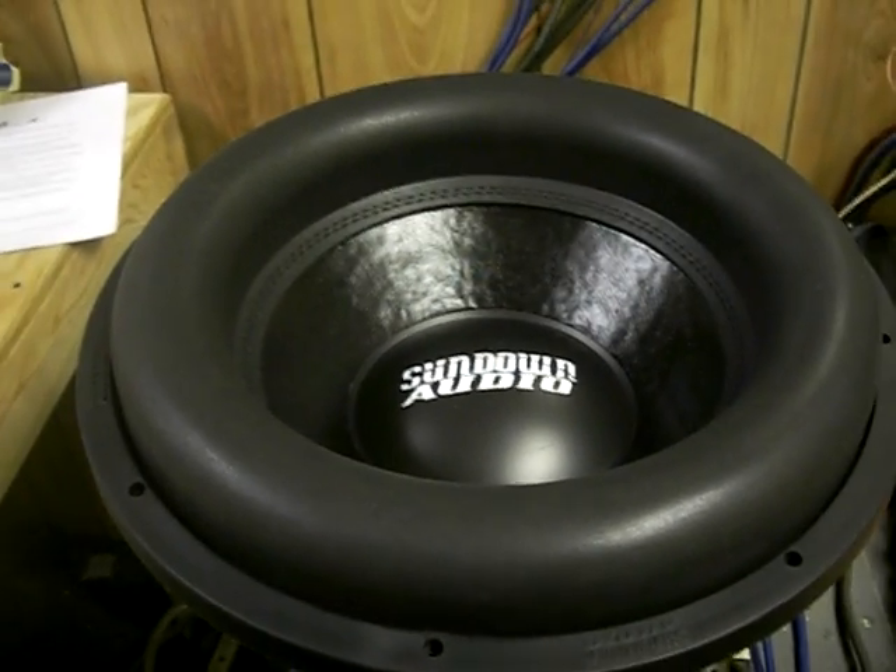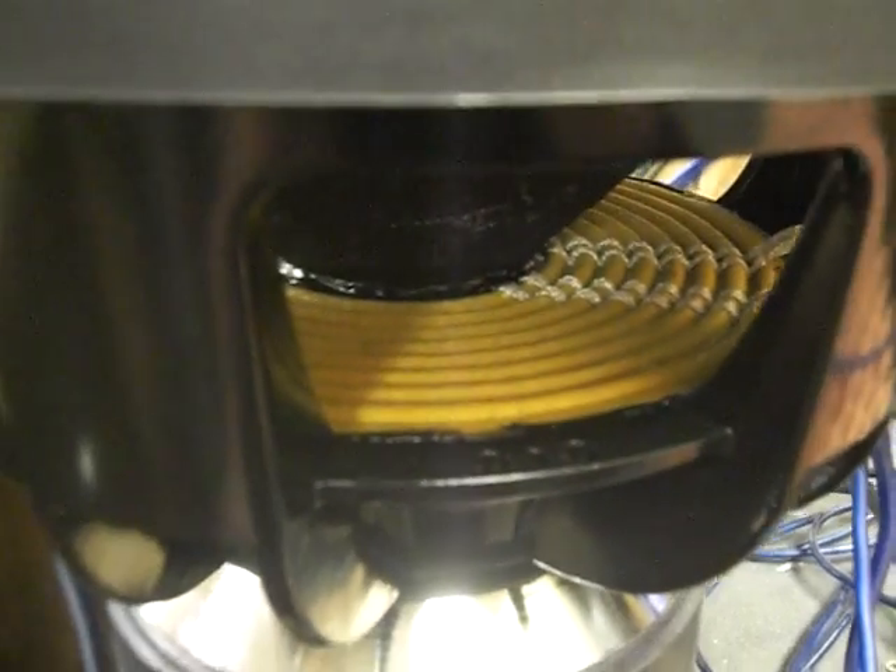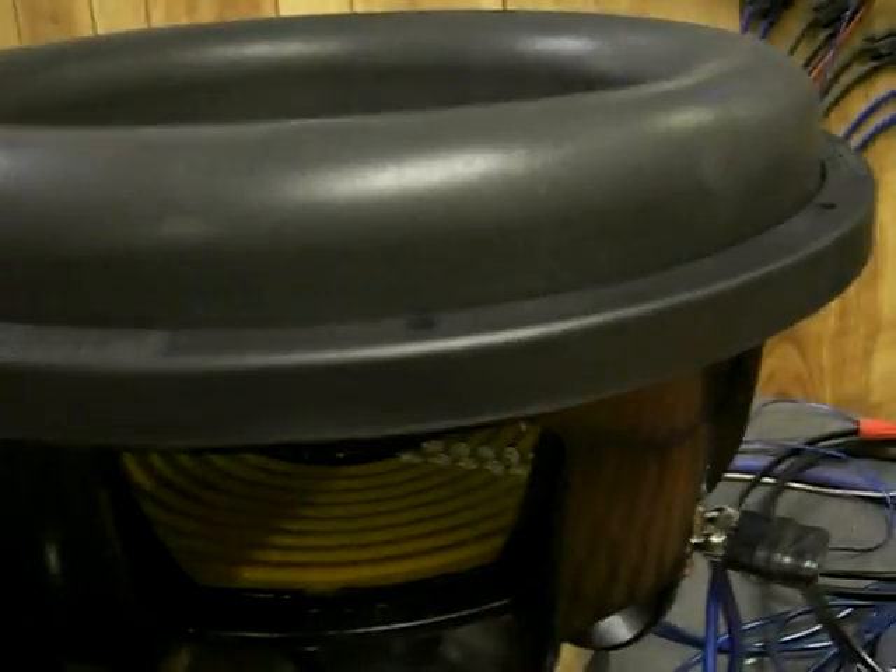We got the ZV415 here and our typical test matchup with the 2500. The 15-inch basket features a 257 millimeter spider. For this particular build, I put the slightly stiffer yellow spider on it since we're still dealing with the original soft surrounds.